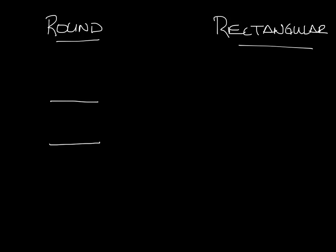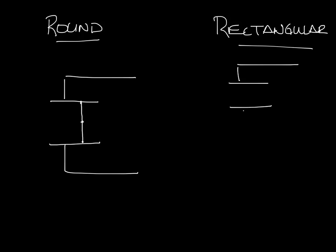So let's just draw the inlet of a single duct box, inside view. The damper will go inside the inlet, there'll be a pivot point in the middle, and then you have gasketing on the end where it touches the inlet. For a rectangular, there's a couple different types. You'll have flat blades like this that pivot off of the center, and when they're open they look like this, and then as they close they angle off like this until they close completely and touch.